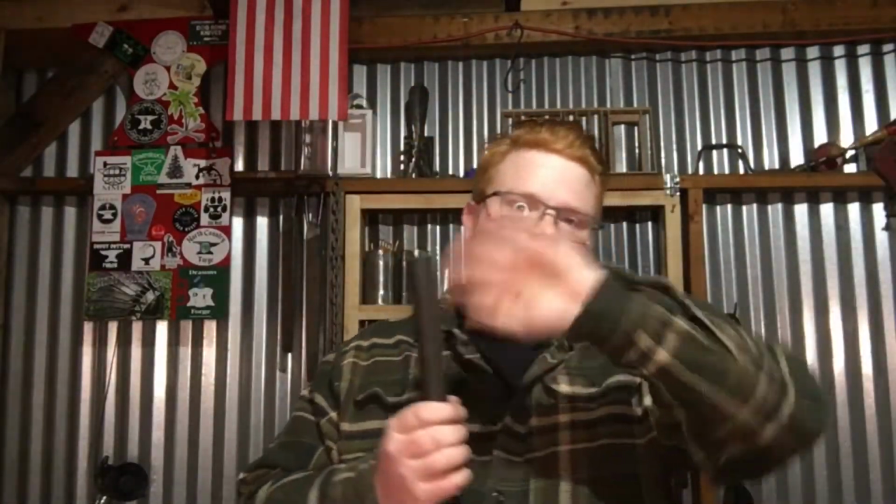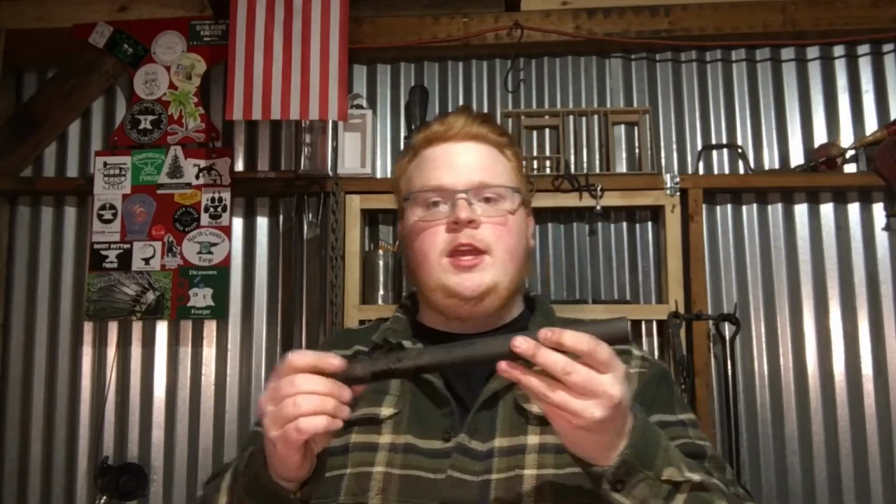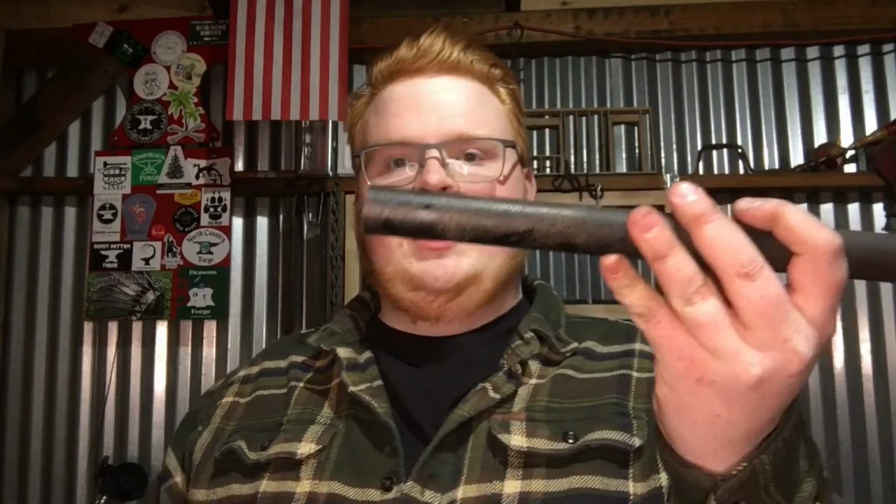Now this is going to get drawn out into a longer taper, and then it's going to get folded over and used. Now I'm going to be cheating using the tools at my disposal by welding on some inch by inch square, solid square to this to be mounted into my anvil, because that's what my anvil actually takes. It's inch by inch, at least my striking anvil is what it takes.